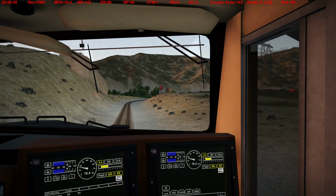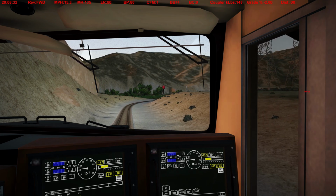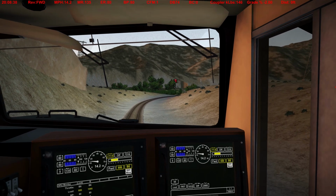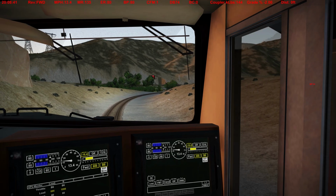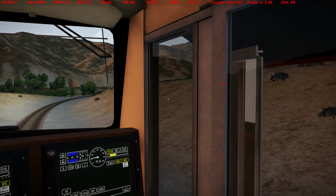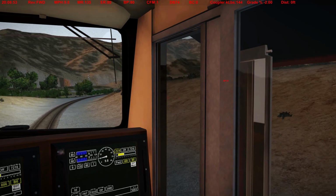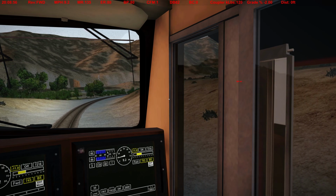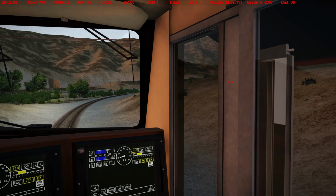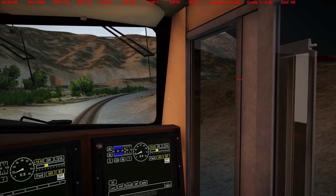Using dynamic brakes. Let's bring this down to 10. We'll be able to speed up pretty easily as we're going downhill, but we don't want to get stuck jamming on all the brakes and everything if we see a red light up here. I suspect we'll be clear because the Amtrak's already out of the way. Amtrak was on our track. We're below 9 now, so I'm going to come off dynamics a little bit. We are prepared to stop. Coming off even more as I'm creeping down well below 7. Looking for a light though.